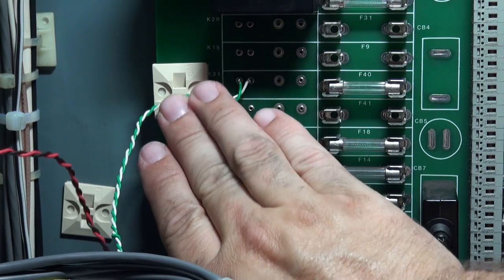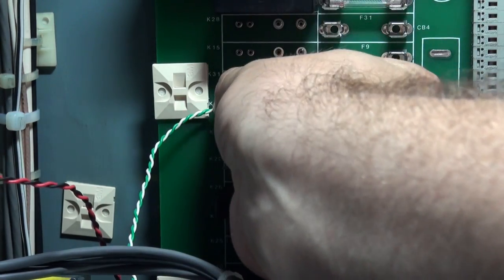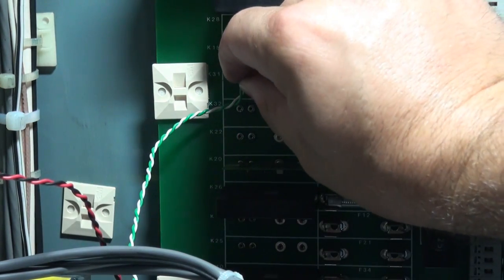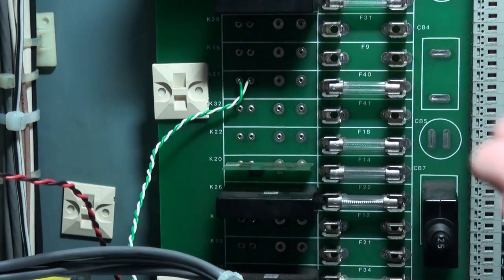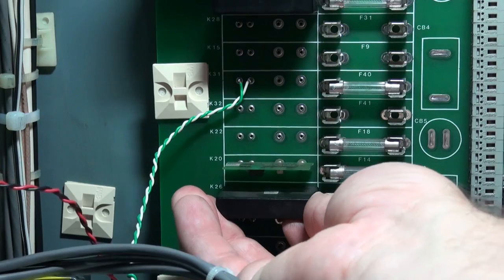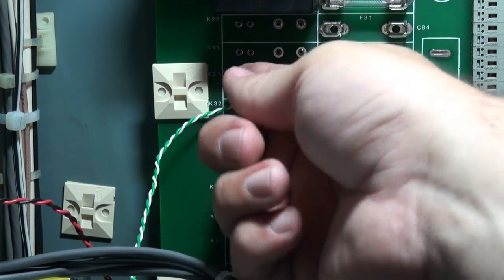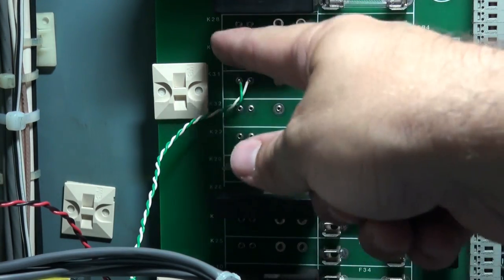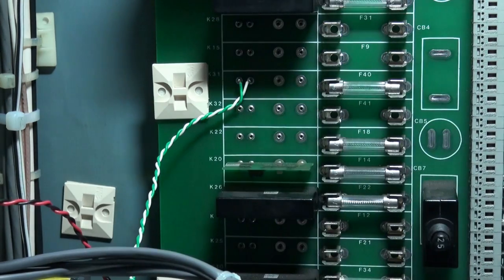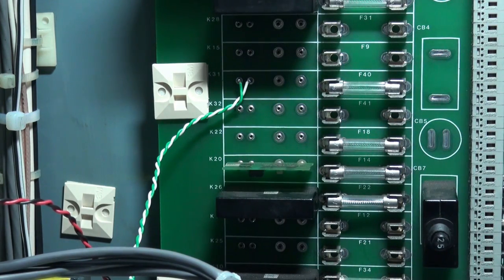So these will be plugged into the board. That will give us our strain relief, so these won't pop out. I mean, you've got to pull on these pretty hard to get them to come out. So they're not going to vibrate out on their own. These modules aren't retained by anything but friction anyway. So I think this will be a good, safe method to get the signal from the machine controller into our Compact RIO without having to go through a solid state relay. It saves a couple of bucks and it's easy. So that's what we're going to do.